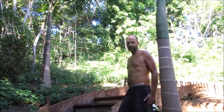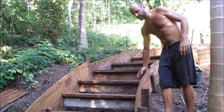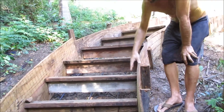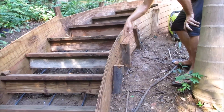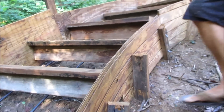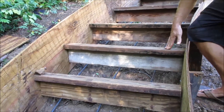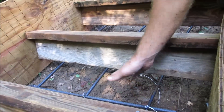Basically read up on concrete work in general, but the forms are the most important part — you need to build these things strong. What we did is put panels and cut them to a specific height, lined the sides of the staircase three feet apart in this case, then staked them in the ground with two-by-four stakes and nailed them to the form so that the form is really strong. Then we used a seven-inch rise, so it's got a two-by-six with a two-by-four on top that's nailed in to the side. When we fill this, concrete will go in to the bottom of the next step from the top of this one to the bottom, so we leveled it out.